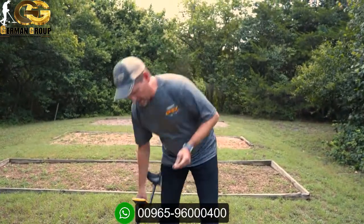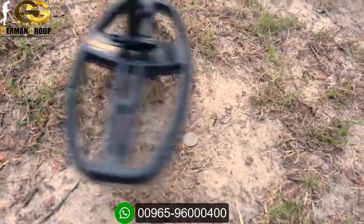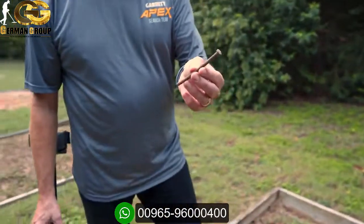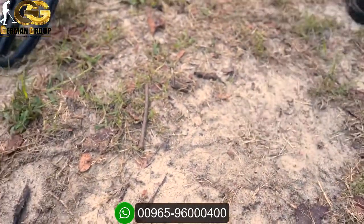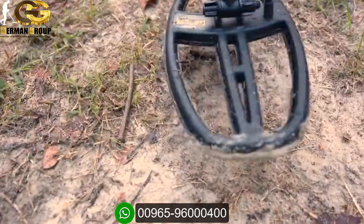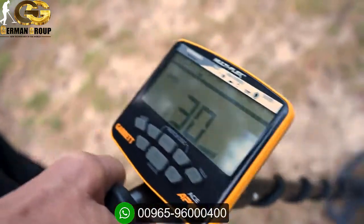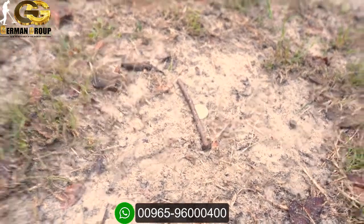Second scenario: I'm using a nickel — a little lower conductivity — scanning over it reads 52, 53 in the low 50s. Now let's take a bigger, thick iron nail and scan it by itself first. The iron is low, reading in the high 20s — 28, 29, 30 — maybe as high as the low 30s, occasionally hitting down into the higher 20s. Now let's put the nickel back down and place the nail right there with the coin.